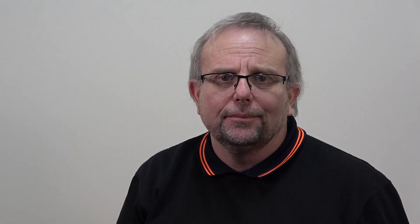Please consult your drive manual for the correct terminals to use and any configuration that may need to be done to your drive to make it work in this mode. If your drive uses common ground mode, connect the ground terminal of your drive to one of the black ground terminals on MASSO. Connect the S+ to the step terminal of your drive, connect the D+ to the direction terminal of your drive, and leave the S- and D- terminals disconnected. There are example drive connection drawings available within the MASSO documentation.